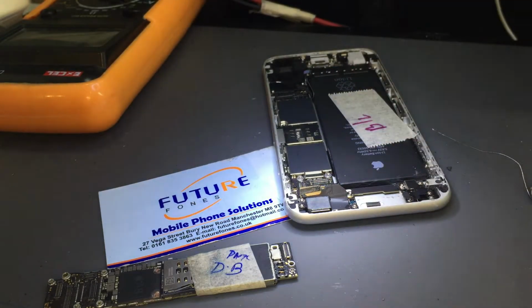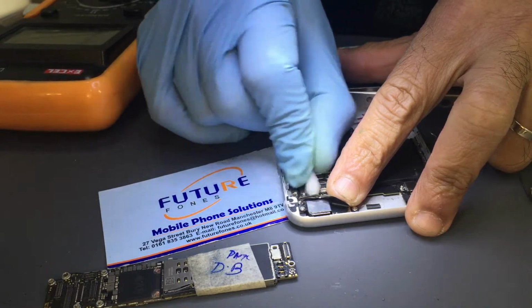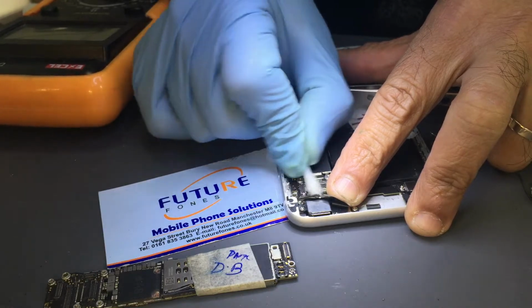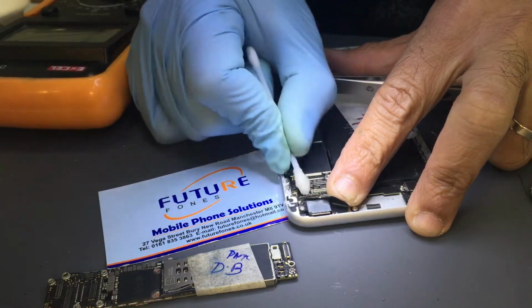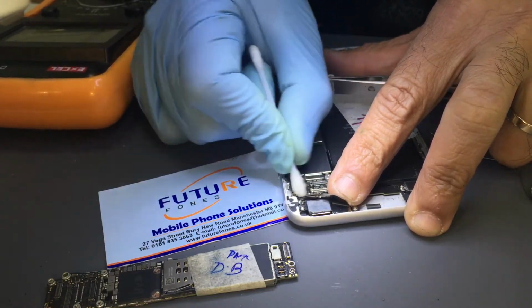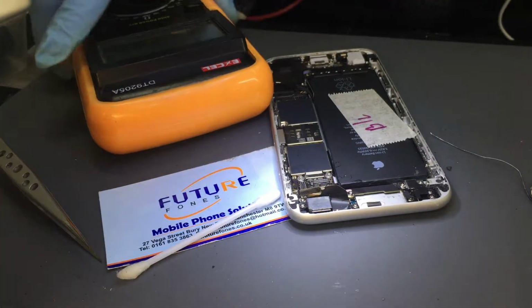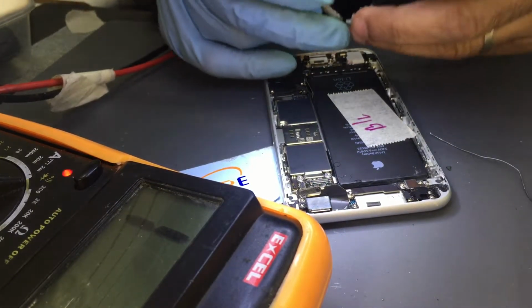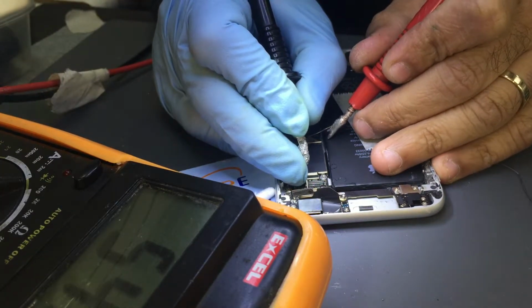Okay, so we have the filter back on. Let me clean the board, do some tests before I put this LCD on, because I did not check the other side of the cap, where it goes to the backlight coil, diodes, and ICs, if that is short to ground. We only tested if that is open link or not. It was open link. Now let's check if it has any type of short. If not, we are good to go. We should have a display then.